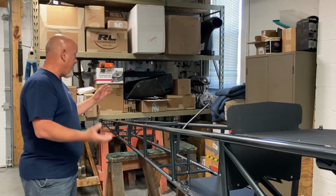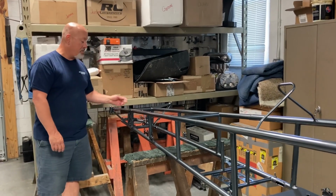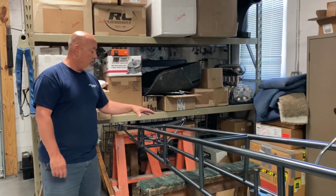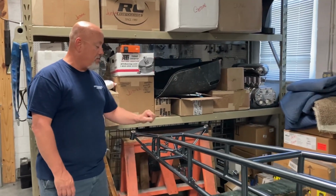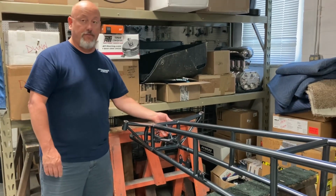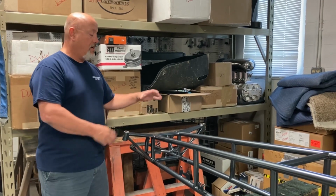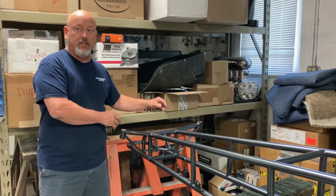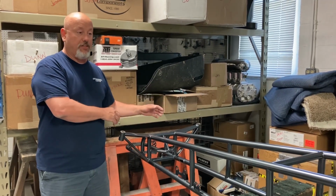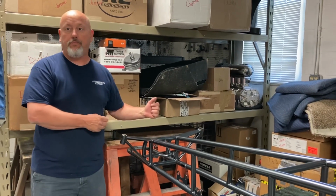At that point, I move back to the front of the car, put the headlights on that go onto the arms. I wire all those, pull that wire with the battery cable. Get all that wire terminated, put the rack in. This car's set up for an air compressor, so I have a fitting here. At that point, I put the battery mount in, and leave the cables unterminated until one of the last things I do. Once everything in the car is wired, I terminate those, and at that point we'll test all the electronics. So this car right here is done.